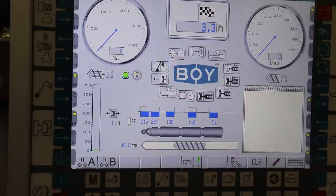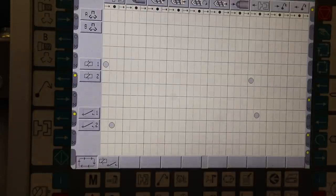Okay, so we're looking at the molding machine controller. This molding machine has programmable inputs and outputs, and it's commonly called TTL logic. I believe that means transistor-to-transistor logic. So when I talk about signals between the robots, the molding machine and the Arduino, I'm really talking about 24 volt signals that signal other pieces of equipment to do something.